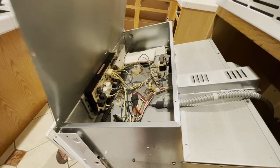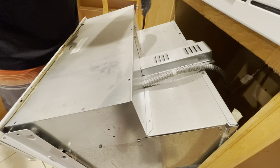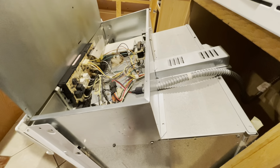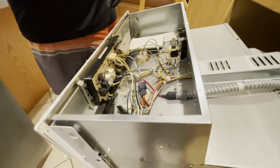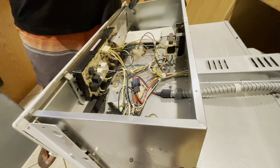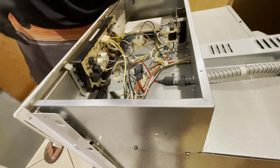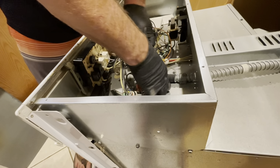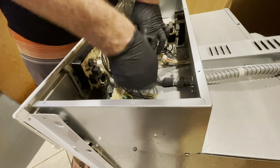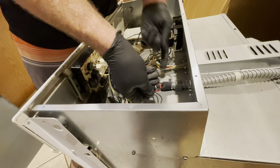Oh, look at that — I learned something. Let me show you: these four screws that were down here, I did not need to take those quarter-inch screws off. This is a cap right here that's popping up, and now we can see what's going on with the electrical. I know I'm repeating myself, but be absolutely 100% sure your power is turned off. This had a quick-connect disconnect. Yours might have pigtails. And right here I need to get rid of that ground, so let's take that off.